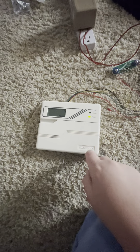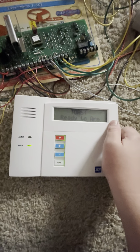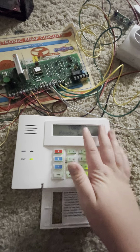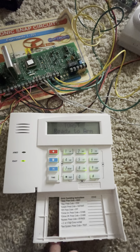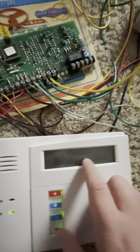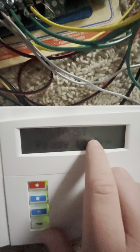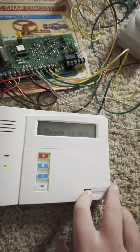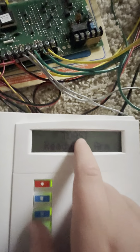I have a 28 first gen hooked up — this keypad has been shown before. I got the door and I re-enabled the door contacts on the SafeWatch Pro 3000. This keypad will probably be going to my SafeWatch Pro 3000, and I'll just have a 6150 RF, not a 6160 RF. On the 6160 RF you can see the toast thing on the screen.